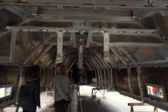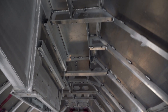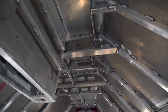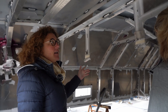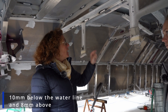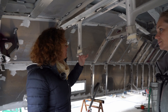It's the hull of a 370. Around the keel box you have the space for the ballast. And as you can see, this one is equipped with a bow thruster. So this is the tunnel for the bow thruster. And here is the crash box — a space completely independent from the rest of the boat.